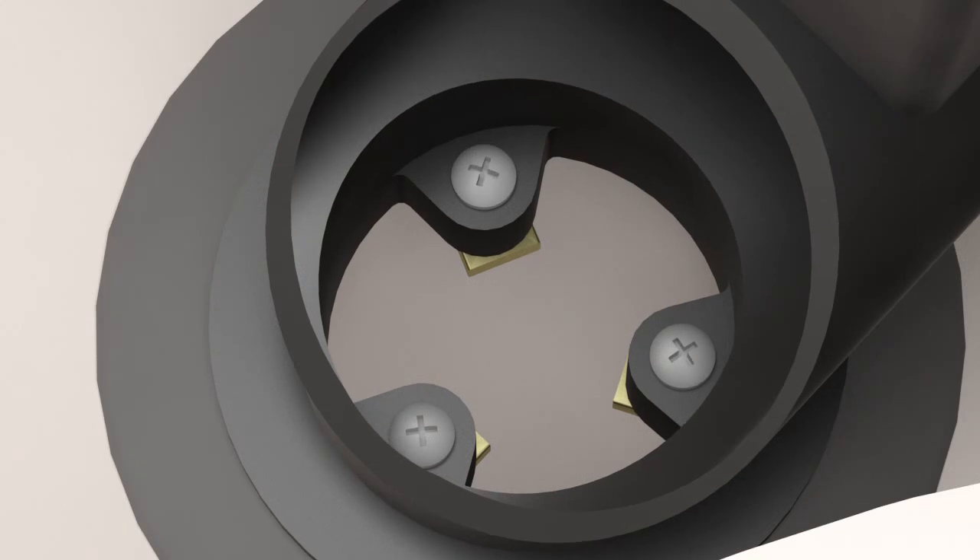Be careful not to over-tighten the valve lugs. Over-tightening may cause cracking or chipping of the vitreous china. If the hole in your tank is triangular, make sure the valve lugs extend under the sides of the triangle and not the corners.